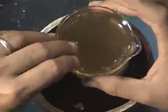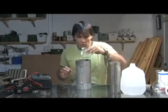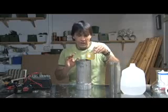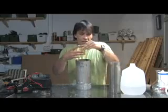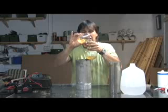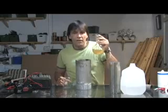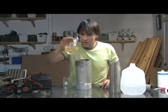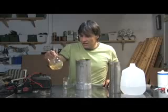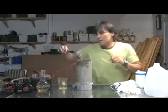This water has turned orange. The reason it's turned orange is because the iron that was in our water has been pulled out of solution. I actually use this as a way to lessen the iron in our water — if you put a little electrolysis before five-micron filters, the five-micron filters are able to pick all of this up. So instead of adding chlorine bleach to do this same thing, you can use just a little bit of electricity to pull it out of solution.